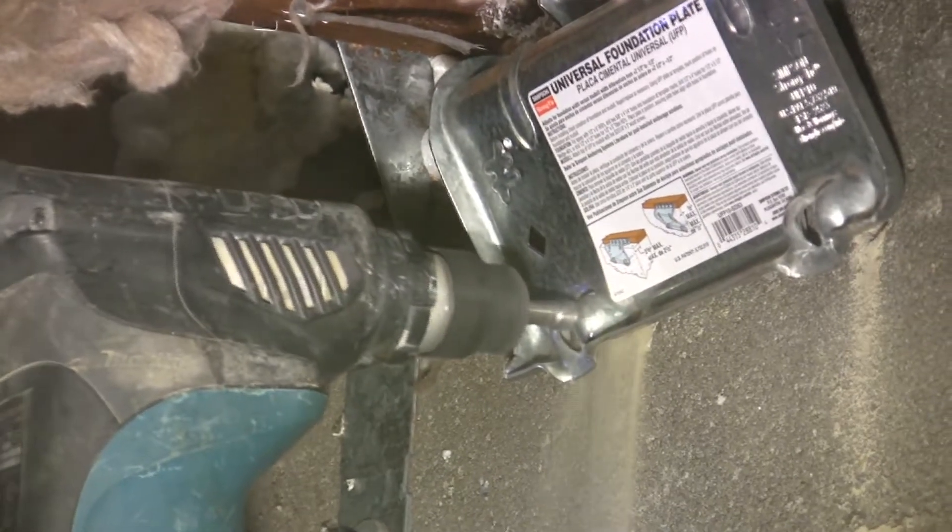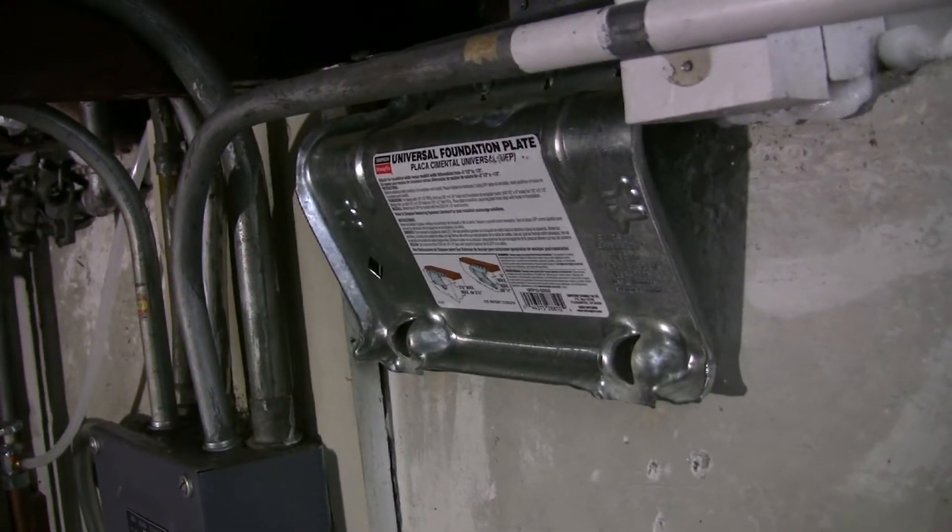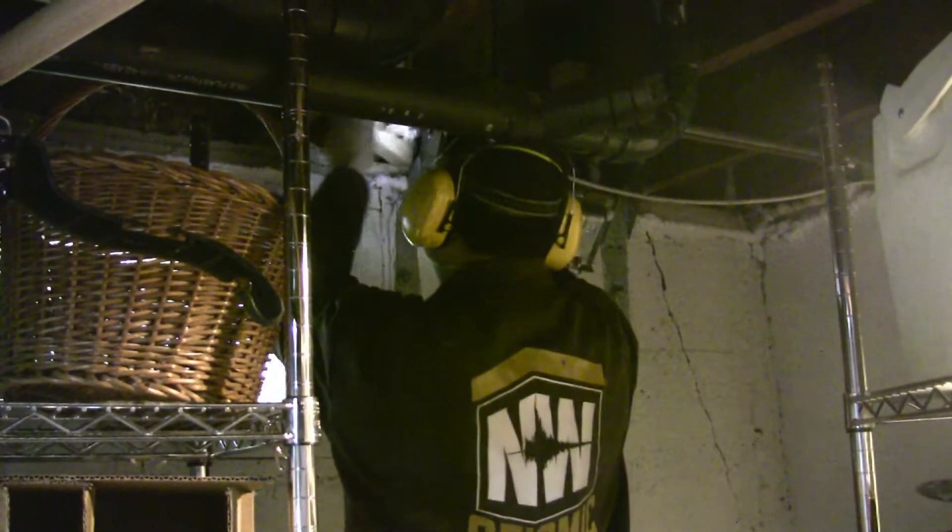Great in a hurricane. So what we're going to do today: we're going to connect the floor diaphragm to the sill plate. Second, we're going to install this — a Simpson UFP. We've done a load calculation for this house and we know that we're going to need seven of these on each wall.